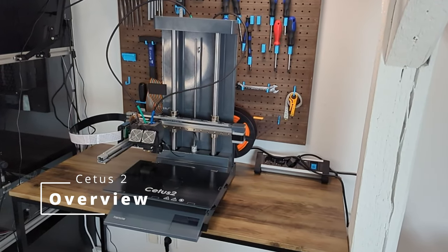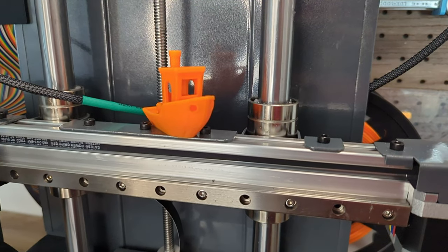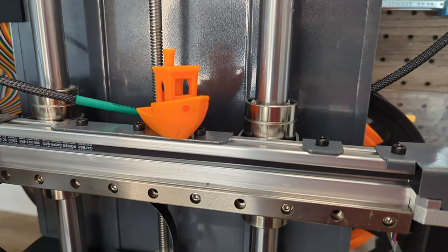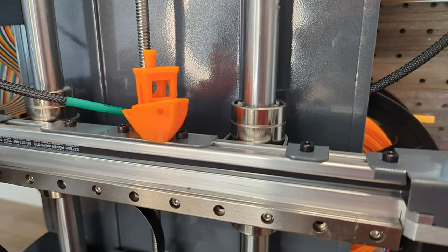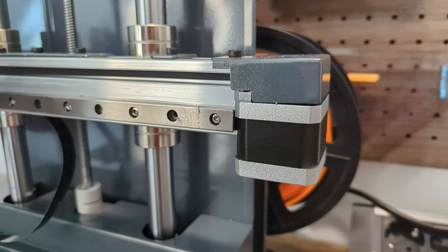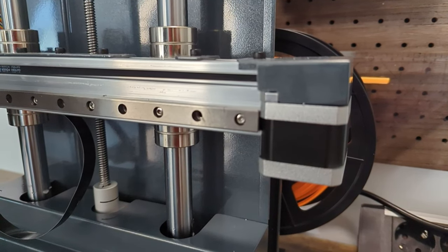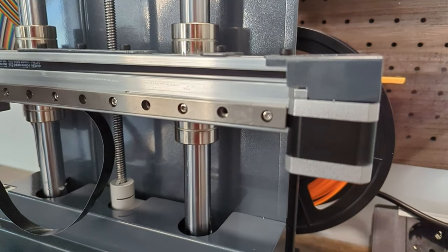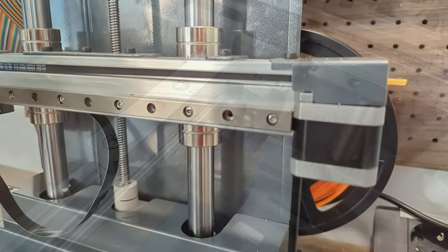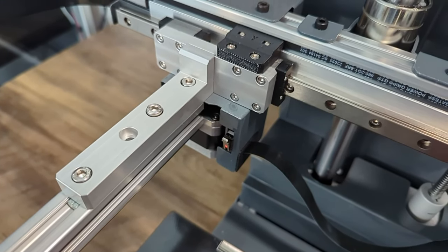After the printer is assembled, let's have a look at the construction. The first thing that draws my attention are those beefy linear bearings — for size comparison, here's a 3D Benchy. They are as wide as the boat, which is crazy. Also, there's no wiggle room on the Z-axis, which is pretty promising. The next thing that draws my attention are those two linear rails, which is also something you don't see on cheaper constructions, followed by these massive aluminum profiles. This construction is made to last for decades. Also, the type of joints they used shows me that the engineer who designed this motion system really knew what he did. Big thumbs up.